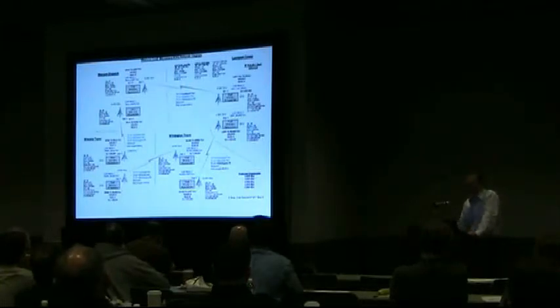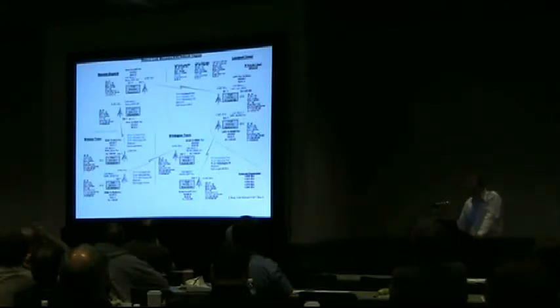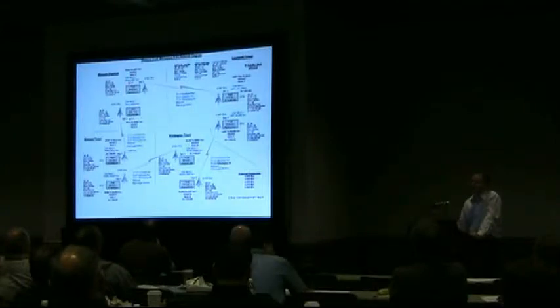So this is a block diagram, a rough diagram of the Exalt diamond in there, and it's just showing one of the technical drawings that we provide back to the customer and that we use for our day-to-day operations. It didn't blow up real well into the PowerPoint, but again, it shows that, for example, down here at our Wilmington tower, traffic can go either direction back. If the link goes down between Wilmington and Lockport, everything's going to reroute, and that has just been great reliability. So we actually increased the reliability for the phone company and saved them money, and then provided the right kind of circuit for simulcast in general.